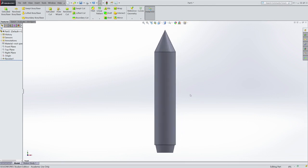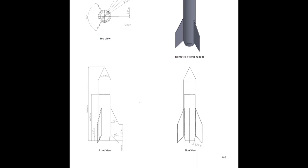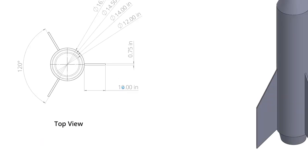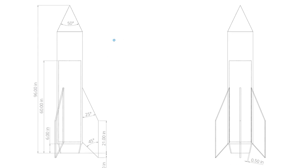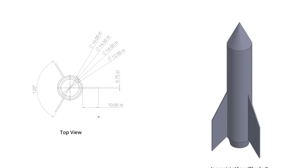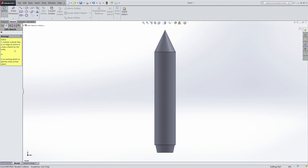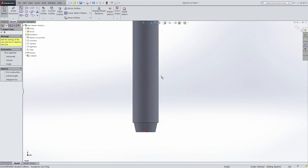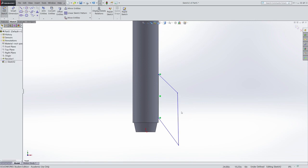Now I'm going to add a fin. I'm going to add the fin on the front plane because I want to make my model match the model indicated in this drawing. The first fin on the right is visible perpendicularly from the front view, which means it would be drawn on the front plane. Then when I create the pattern, I end up with fins that aren't aligned to any of the primary planes. So if I jump into the front view and create a sketch on the front plane, I can create the shape of the fin — a line, then a line, then a line, then a line.